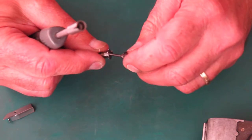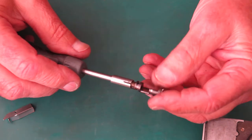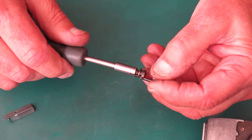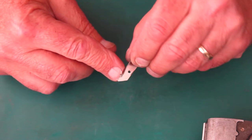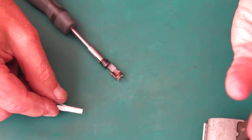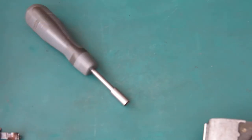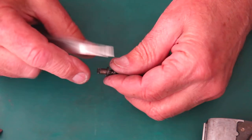So with this on the cam, this piece slides over the top. The slot engages with a spring. From the front, you can easily wind up the tension on this. You can hook the spring into this little bracket. There's a little hook there in the bracket. And then that's done. That's cocked, ready to go. It's much easier using this than my old method, which was to use a stiff pair of tweezers and fight to get that spring wound up. So I'm very pleased with this.